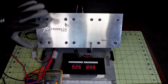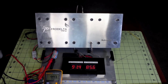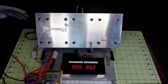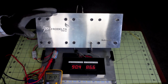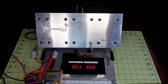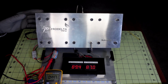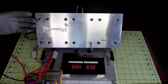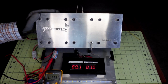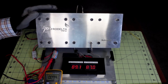The idea behind this is that it's small, it's compact, it can be installed anywhere. It doesn't have any moving parts or require any maintenance for years and years, and it can generate enough energy to power small devices. We are building a 1 kilowatt hour module, and I'm expecting this module, when installed in a residential setting, to generate about 500 or 600 watts per day. As you turn on your dishwasher or dryer or any other appliances and you have this waste heat, these modules can sit in the back quietly doing its job, providing a good amount of power without any maintenance required.